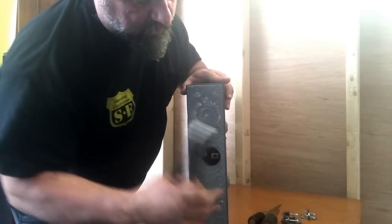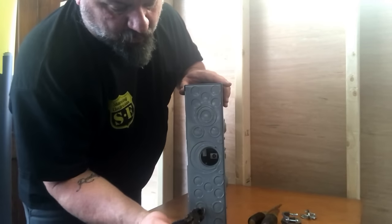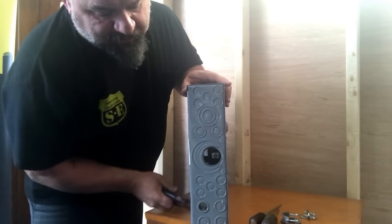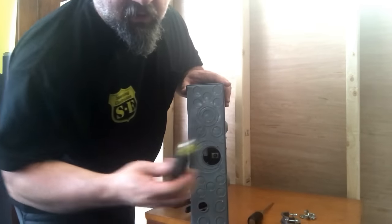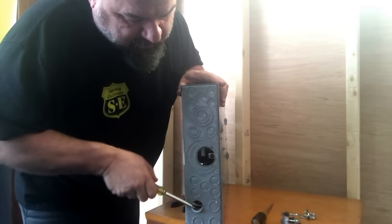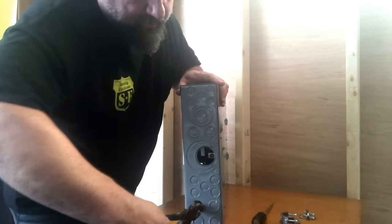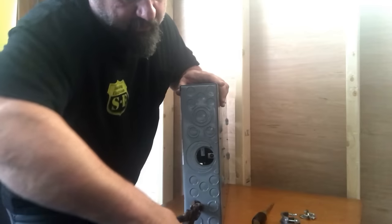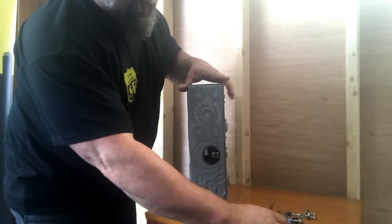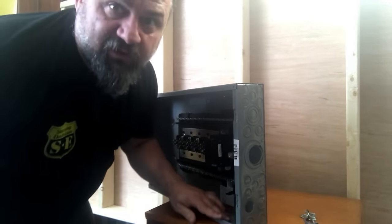We're going to do a service entrance conductor and a 3/4 inch knockout for our Romexes for our home runs. Just like the other one, twist it out, get your screwdriver, 1, 2, do the old taco maneuver, look at that, right at the welds, and just inch it out of there. Nothing to it.